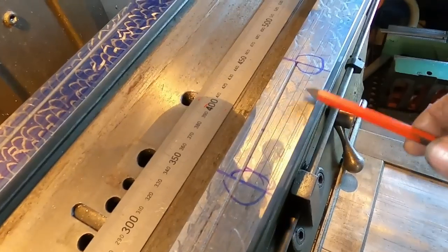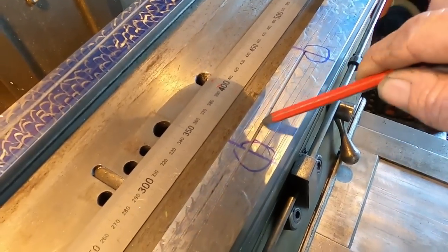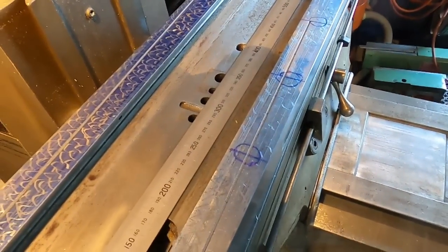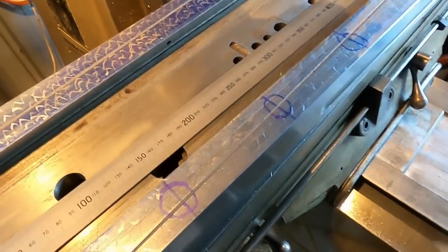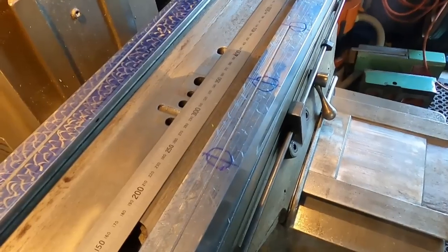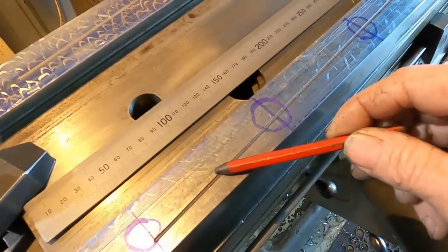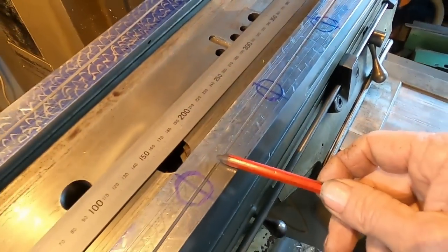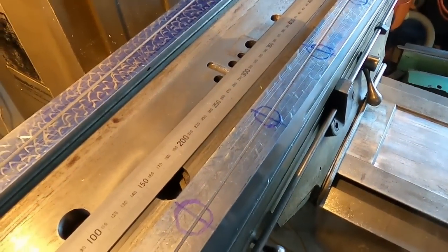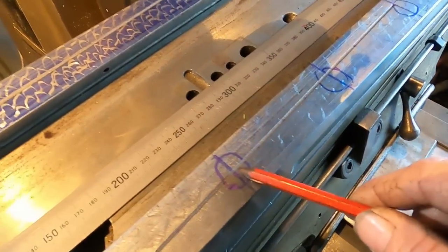The other thing, this cross slide's been starving for oil a fair bit down this way here. Now whether that's related to the design of this oil groove or operator just not oiling the machine enough, we'll never know. So to improve it, I'm going to cut some circles in it. Now I've seen this done before on another machine on a scraping forum, and I thought, well, that's a good option, as I didn't really want to start, I mean, a zigzag groove along here would be great. Now I didn't want to start recutting the original oil groove and just make it look like a total dog's breakfast under here. So I'm going to go with the idea of putting some circles in that will be linked by the existing groove.